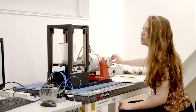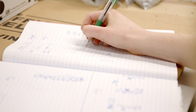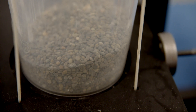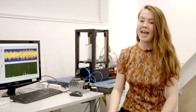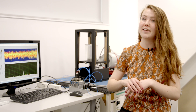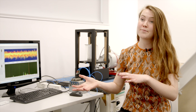I'm also looking at the best equipment we could be using — finding the best frequencies and power to design a piece of equipment. I built a fake aquifer, which is just a big container with gravel and water in it. It has a fake well in it. I grew bacteria in little bags on gravel for about nine months, buried them at different distances, then vibrated it at different frequencies with different equipment and measured the bacteria we could sample.